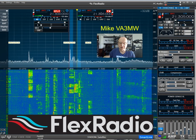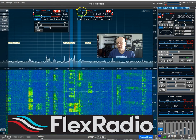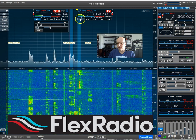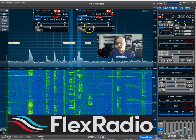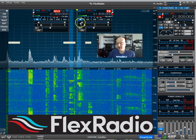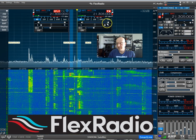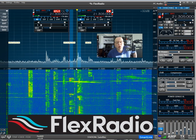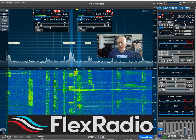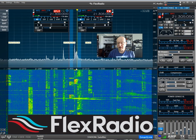We want to be talking on his listening frequency. A couple of key points: split is set here. I've got antenna — everything's on antenna 2 in this case. Let's drop down my speakers and make sure our AGC is set correctly. What I'm going to do is put him all the way on my left speaker and slide everybody else to my right speaker. Very cool in headphones — so I can always hear him calling, listening up, or his call sign. Then I'm going to use my knob to dial around as needed.